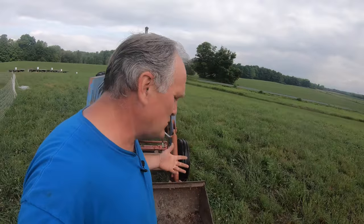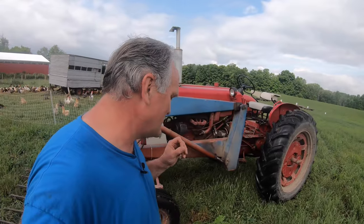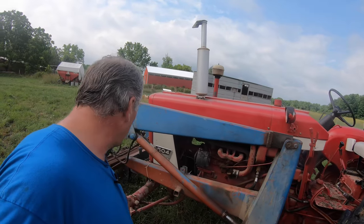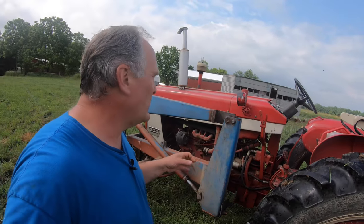This tractor was a complete basket case when I bought it — it barely ran, and the front wheels pointed two different directions. I bought it for about three grand, which was probably too much, but I liked the tractor. The engine was clapped out so I had to rebuild it, and I had to redo the entire steering system with the help of my dad — all new tie rods up front. It's got four new tires, which is a big cost. I went through all the seals and hydraulics. It's reliable now, though it's a little too small for loader duty. I'd like to get another 656 for loader work and relegate this one back to pulling hay rakes and wagons.